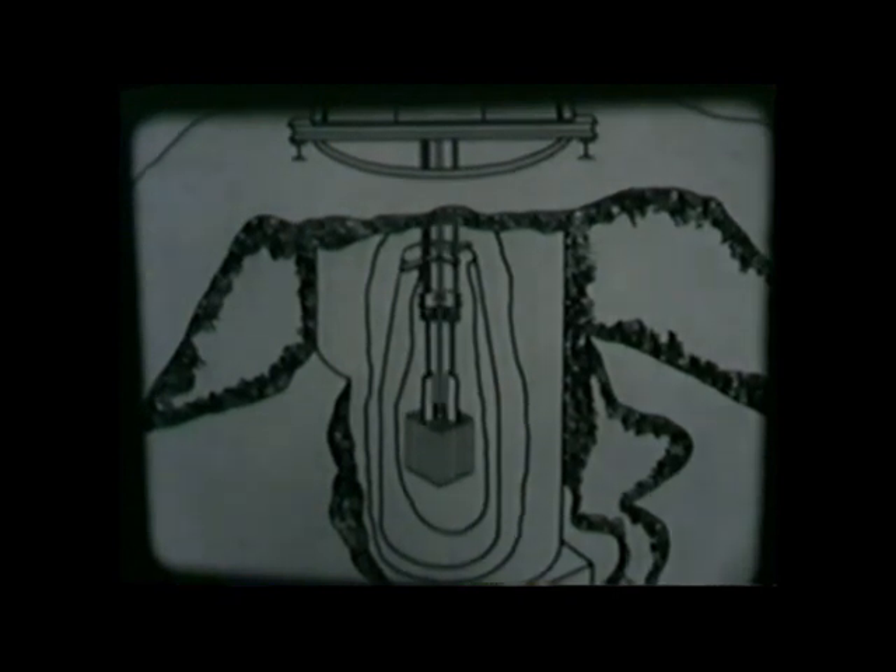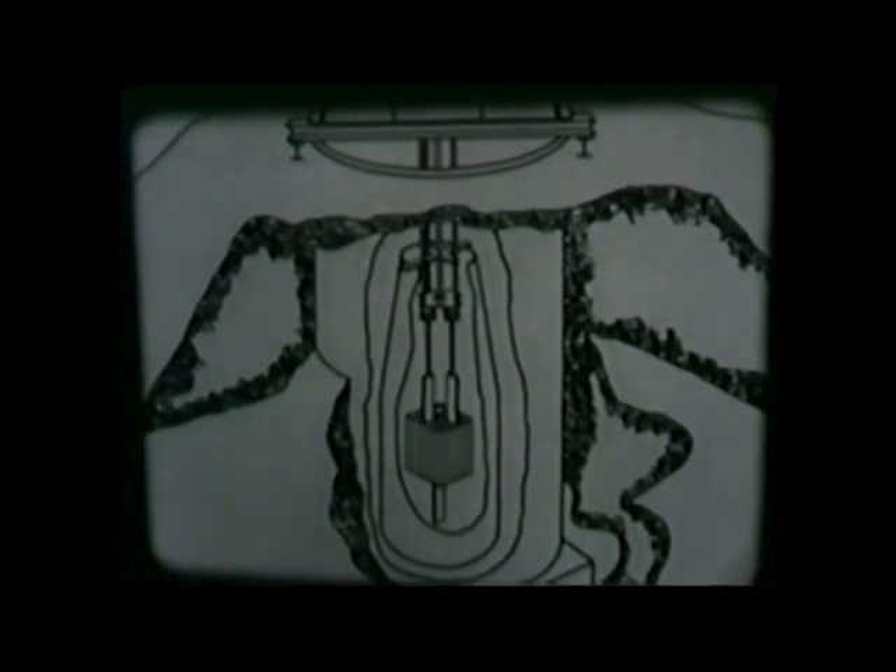To make an experiment, the rods were positioned to make the reactor critical at a low power, about one watt. The center rod was then dropped out of the core, making the reactor supercritical. The power was allowed to rise exponentially until the formation of steam made the reactor subcritical and ended the power rise. After it was evident that the reactor had terminated the power excursion safely, the four outer control rods were dropped in to end the experiment. For the experiments to be described, the tank was left open to make visible the effects of steam formation and the resulting expulsion of water from the reactor.